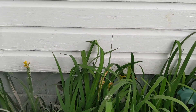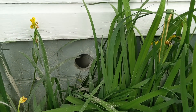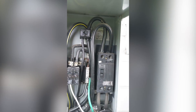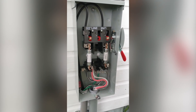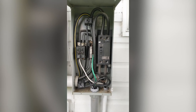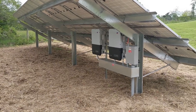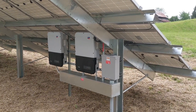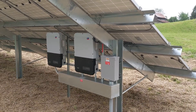That makes such a perfect hole. Wrapping up our line-side taps — we have 2/0 connected to 4-aught and a fusible disconnect, everything built for 100 amps. We might be back easily to add another 10kW solar and a couple more inverters. We're done — another dual SMA transformer inverter install. These are great. We put cell cards in, they're connected and tested, and we're making about 4,500 watts on a cloudy day.